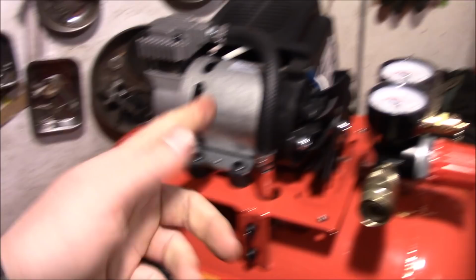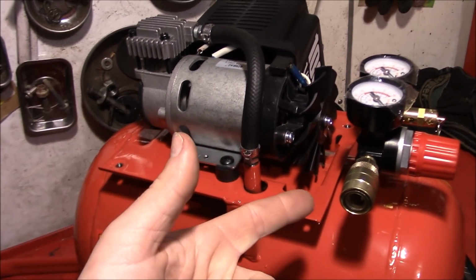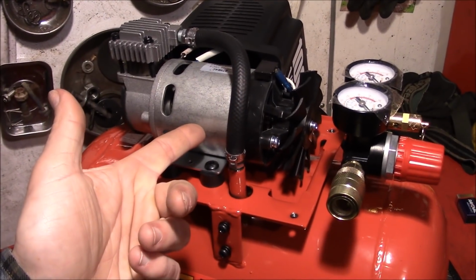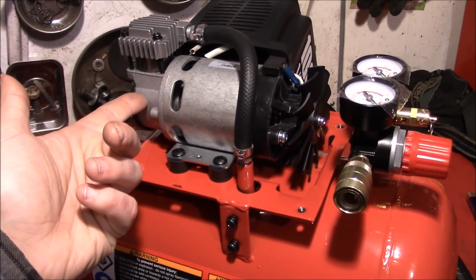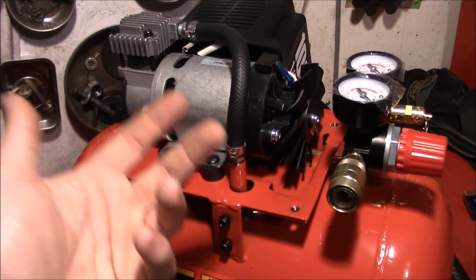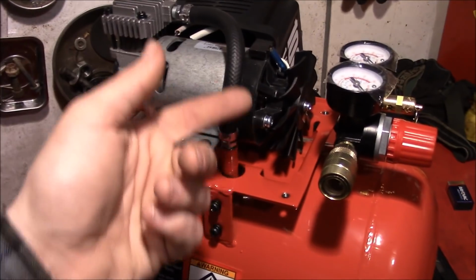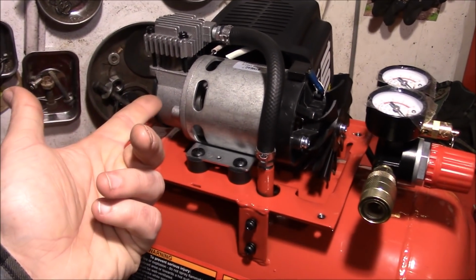On a bigger motor, I was figuring we were going to need quite a gear reduction from the chainsaw for the pump motor. Usually I figured these things would be spinning around 1,000 RPM max. So the chainsaw running at 8,000 or so, give or take, you're going to need roughly a 10-to-1 reduction from the chainsaw to your compressor pump.